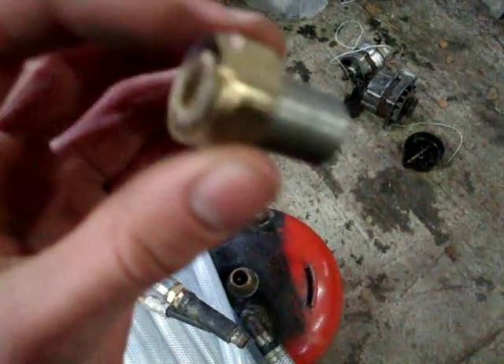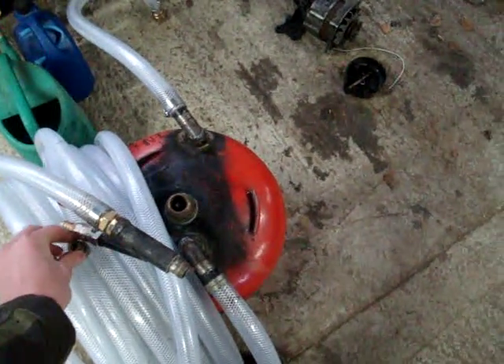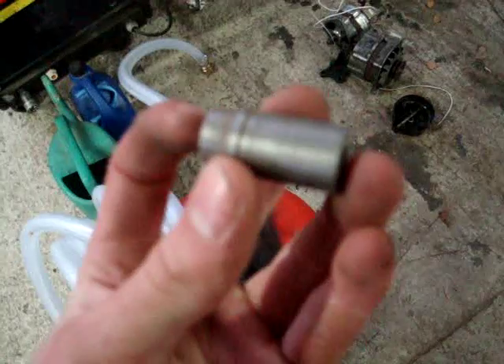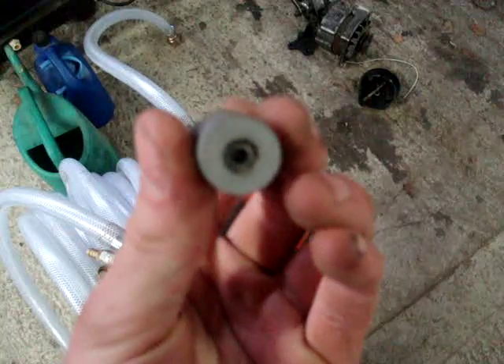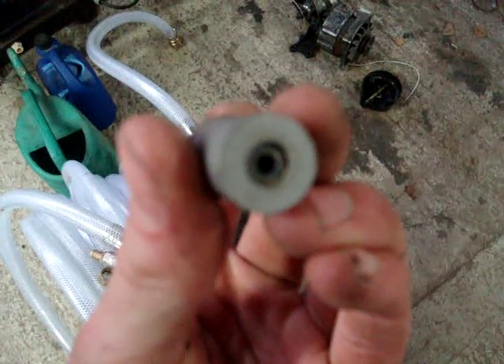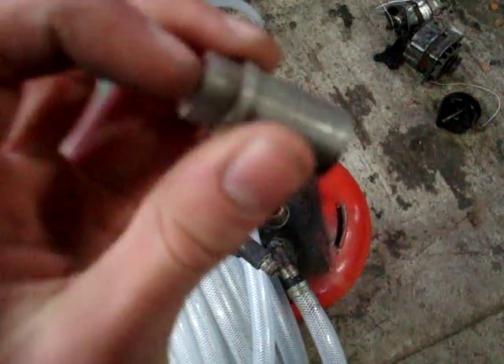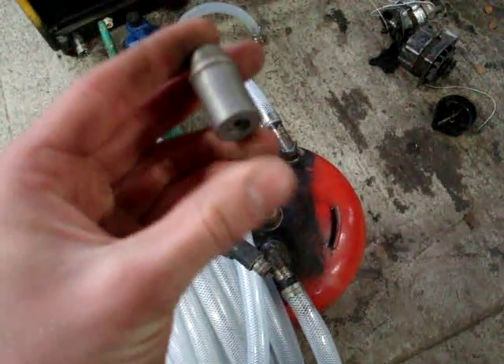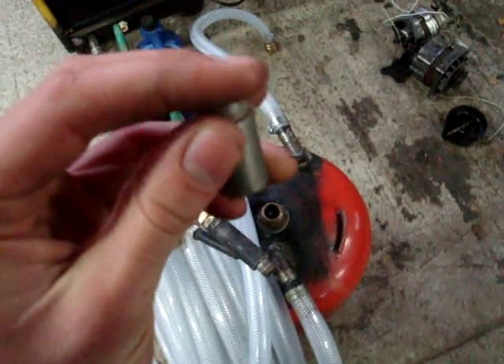For a nozzle, this is it — I made it on the lathe. It's just got a brass half-inch end cap on it, a lot like the ceramic nozzles you get. It's steel, but inside there's a tungsten carbide insert. You can get those — they're 3.5mm — on eBay for about 20 quid. For tungsten carbide, that's pretty good. I got a bit of rod and cut it in half, so I've got a spare one when this one wears out, if it ever does.